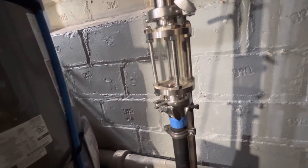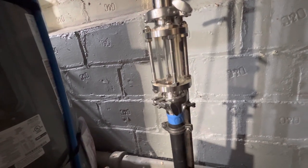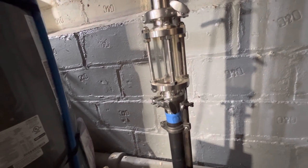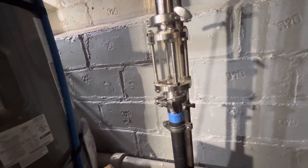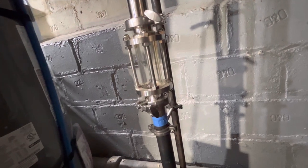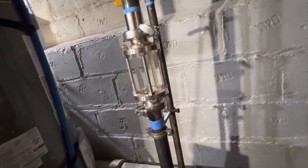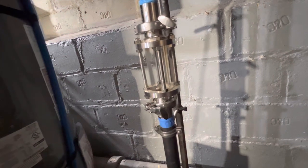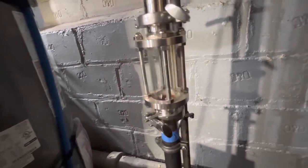This is a two-story house with something like, I think, 7 radiators. And the pitch on these pipes that feed the radiators is a very gentle pitch. What is it supposed to be, like a quarter inch per foot or something? I don't have any low spots that I know of, because I don't have any water hammer. There's no low spots that hold water. So it takes quite a while for all the water to come back to the system. It does this for several minutes after every call for heat.